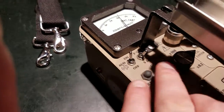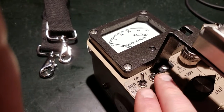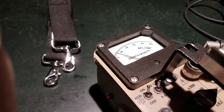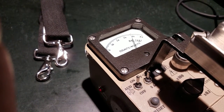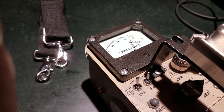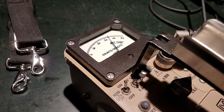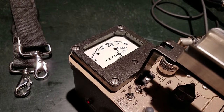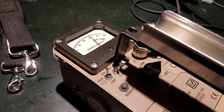It's also got a reset button that resets the counts it has stored. Here's a little trick I use when measuring samples: switch it to fast mode and measure your sample — this is the cesium-137 again. Once the needle kind of gets to an area and starts jumping around a region, you switch to slow mode. If it stays in that region, then you can take your reading. That's a pretty cool feature.